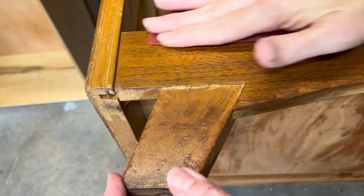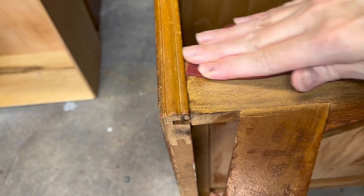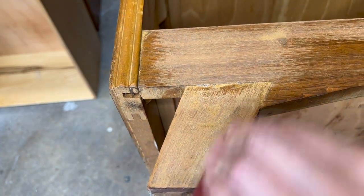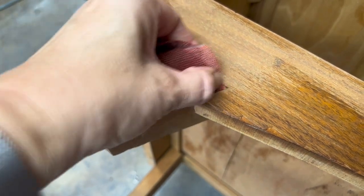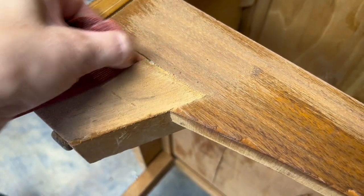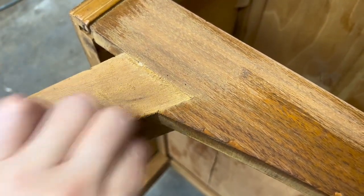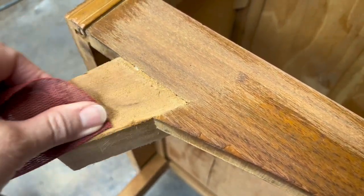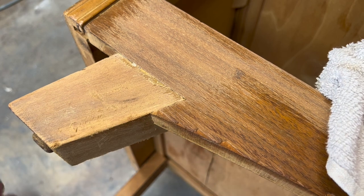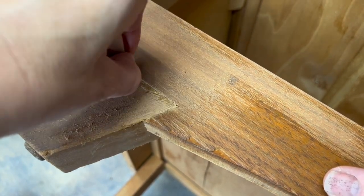The goal of this piece was to try to strip the drawers and the base and keep those wood. I'm just going to start with 80 grit. Sometimes these old pieces have hardly any finish left on them, so you can just go in with sandpaper — you don't even have to use a stripper, and it was coming off really fast. I went in with 80 grit and worked it, then I'm going to go through the grits. There was some glue stuck in one of the little crevices, so I used 80 grit to get the finish off, then sand again with 120, and then go up to 180. Then I'm going to pause and decide — I'm not sure if I'm going to use gel stain or Danish oil, but I kind of pause at 180 and decide what finish I'm going to use, because sometimes I need to go back up to 220 depending on the actual finish.